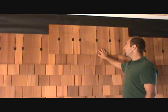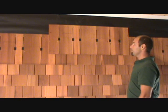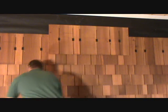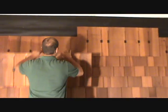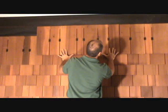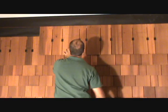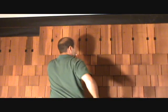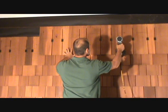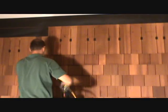Once we've installed the first panel, you just finish out the course by alternating A and B panels in both directions. The panels also alternate in the carton, so you can just take the next one out of the box. That one was an A panel, so this one is a B panel. Then an A panel, and so on until you finish the course.